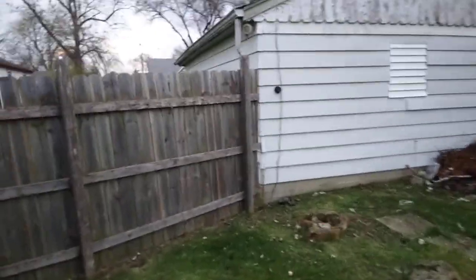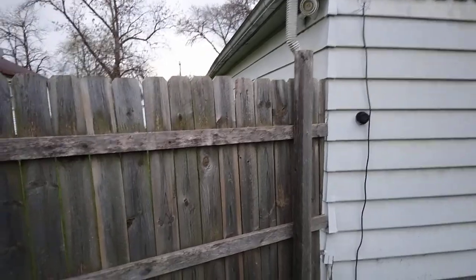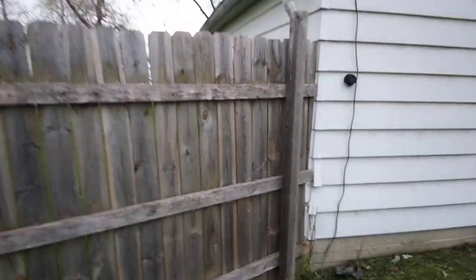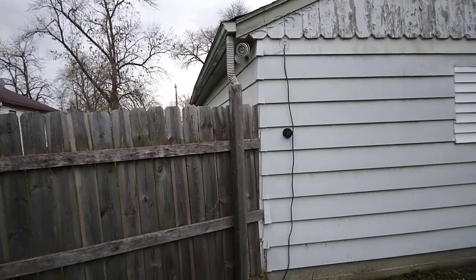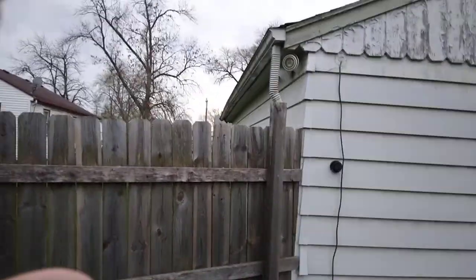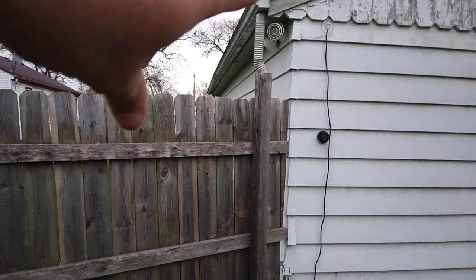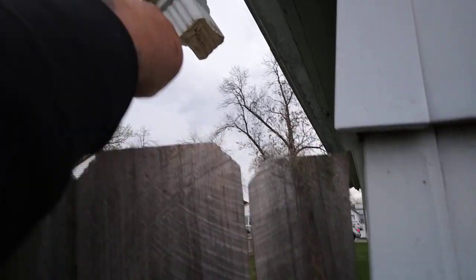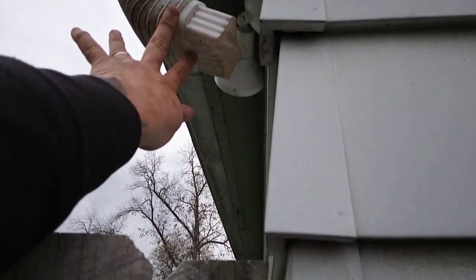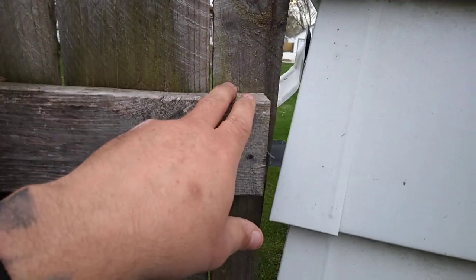I have an old rain gutter up on here. This rain gutter has been plugged for quite some time and the water all leaks out on one end. I think something with the gutter guard plugged it. What I'm going to do is get up there, cut that gutter guard off, and clean out the gutter. Where this flex pipe is, I'm going to take a normal pipe and run it along the side of the garage and come down to this first beam and come out here.